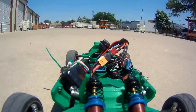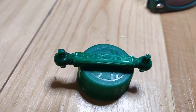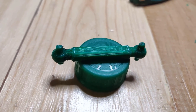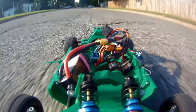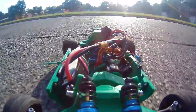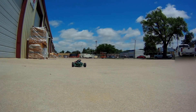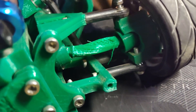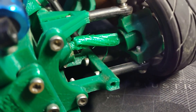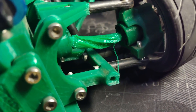The car works better than I imagined it would, and I never thought that PLA CV axles would last this long. As you can see here, the axle has run more than 10 hours with rough driving like what you see in the intro, and they're still holding up pretty good. Before I had the print settings dialed in for this specific part, I did have several breaks — not where I thought they would be at the nubs, but actually mid-axle: they would snap, bend, or twist, which you should be able to see on screen right now.